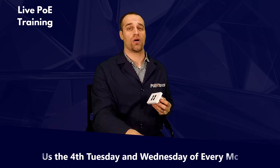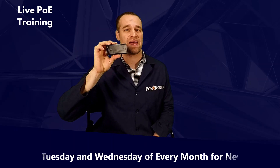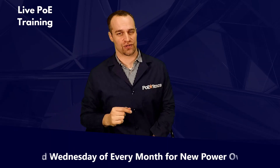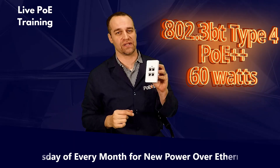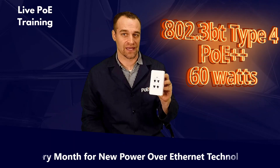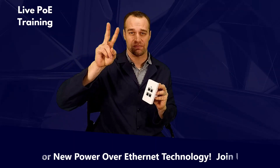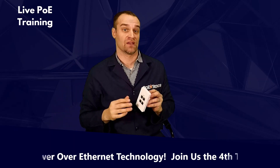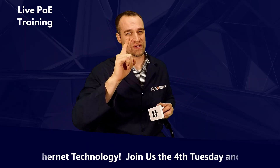Or you can add one GAT USB-C PD to send power and data to your iPad Pro Gen 3 or Surface Go. However, to get the very most out of your GBT4IW, you can connect it to IEEE 802.3BT Type 4 PoE and have a full 60-watt PoE budget. That's two PoE Plus devices, or four full-capacity PoE devices. For example, you could use four of our PoE to iPad adapters, all in one cable.